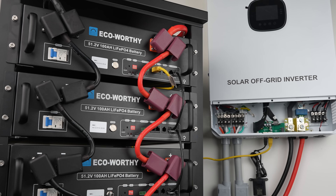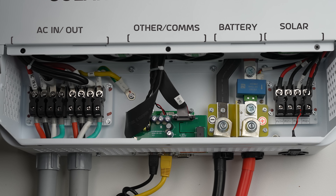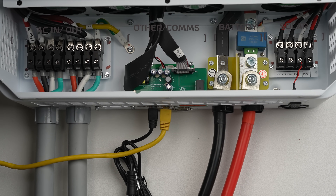When it's all said and done, this is the setup you can expect. We have all our batteries interconnected, then hooked up to our inverter. The inverter, in turn, is connected to our electrical panel and solar, if applicable. Here we've removed our terminal cover so you can see the system configuration. On the far left, we can see our AC connections — we can use AC power to charge our batteries, then use that power to feed back into the grid during power outages or peak times. Next, we have our communication cables for remote monitoring and configuration, our battery connections that feed directly into our battery system, and finally our solar connectors. Because it's all interconnected, we can easily configure battery charging times split between solar and AC, battery usage times, backup modes, and more.